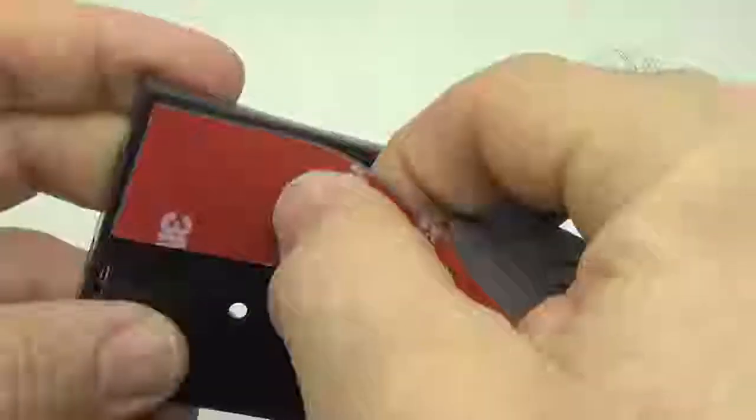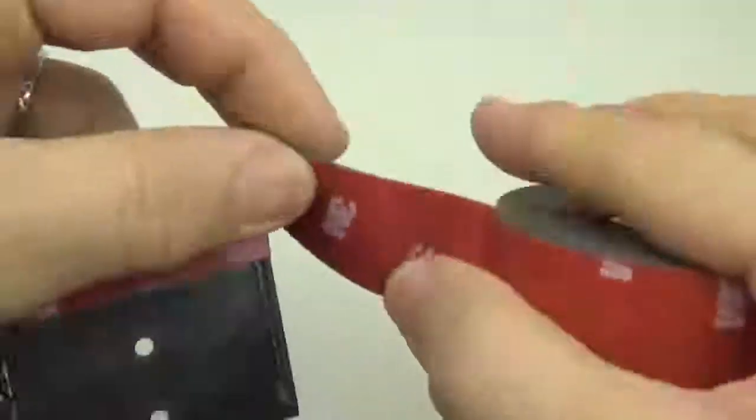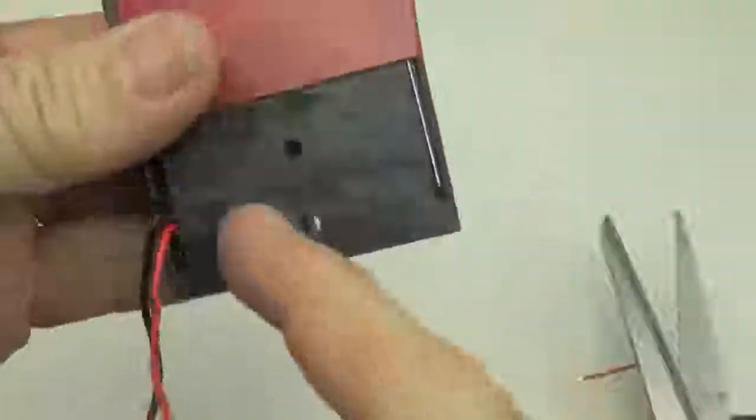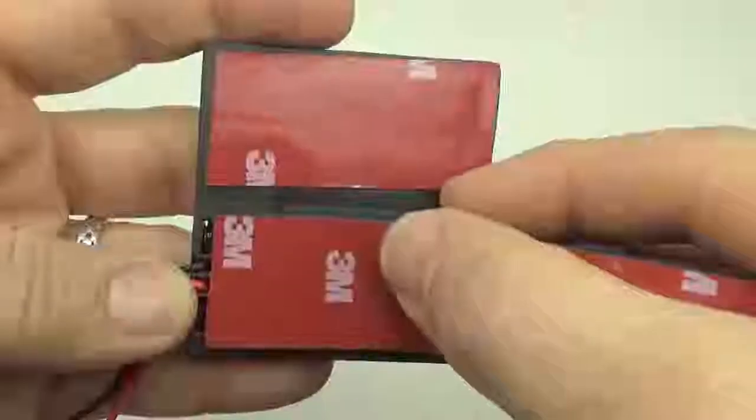Do you ever have to use more than 10-pound tape to get something to stay permanently? No, usually it's okay, because once the loggers are together, you find that they tend to compress the tape. So as they age, the adhesion gets better. But when you're just putting it together, it doesn't hold sometimes. Again, it's kind of a surface effect. This plastic has sort of a pearly surface, and that's what's really preventing the tape from getting a good grip on it.